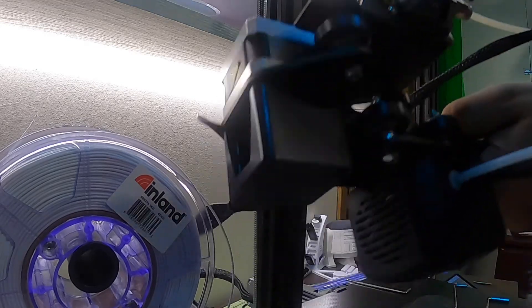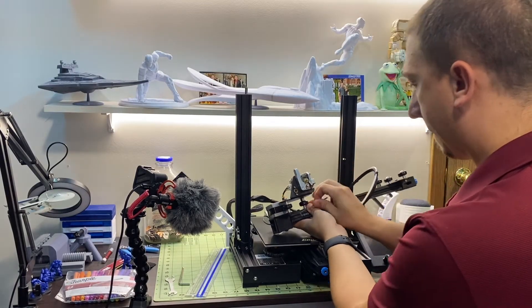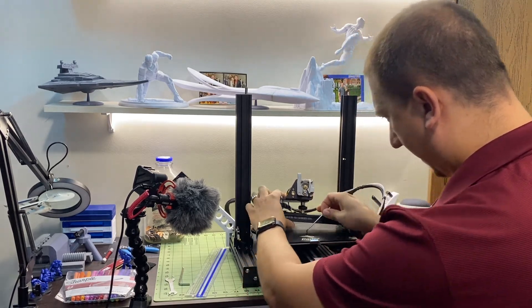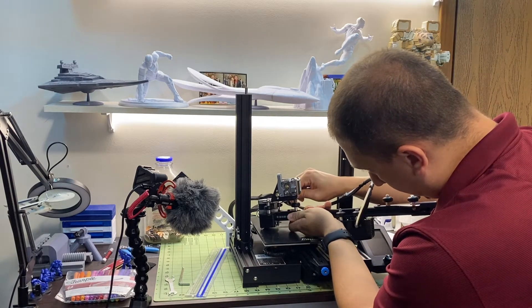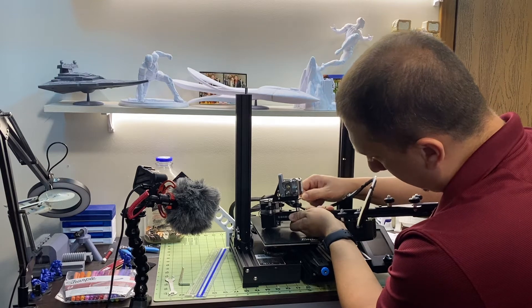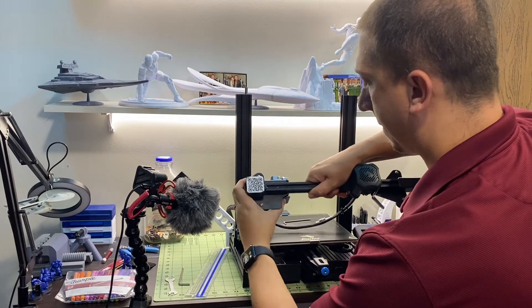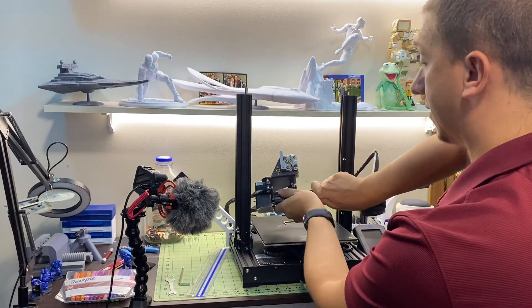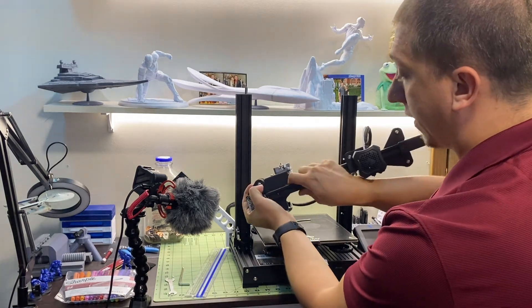You can see I had a good crank on that one. You can actually come in from this way — it's hard, but you can get your Allen wrench in there, come in from this way, get it in there and try to tighten it up a little bit more. When you've got it tightened up, see — there's no more flex in that bar. Remember, this thing was just bending for me earlier. So now we've got this all straightened out, we've got those nuts tightened, we've got no more flex in the carriage. That's exactly what we want — no more flexing right there.